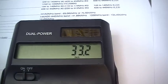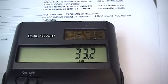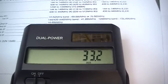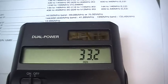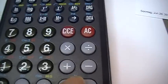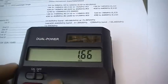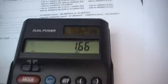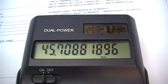So that means voltage wise, 33.2 dB, what does it mean? The ratio on voltage. So that means 33.2 divided by 20 means 1.66, and that 10 exponent 1.66, what is it? So there it is. That is quite a lot.